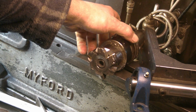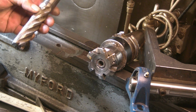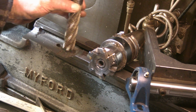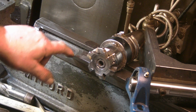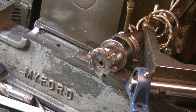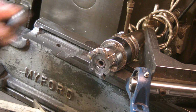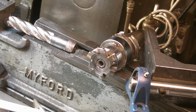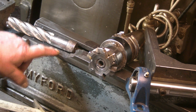So I'm going to experiment with some other cutters I've got. I've got this large roughing end mill, which I don't think I've tried on cast before. So I'm going to give that a try, maybe on this shoulder and possibly on that side of the way. But I have got some other face mills that do allow for a 90-degree shoulder there, so I'm going to try that one as well. Maybe try that one across there to give me that 10 inches from this point. But I'm sure you don't want to be watching 2 hours of machining cast iron, so I'm going to do that off camera and bring you back on the next one when I've got that down and hopefully mount the plate on. Got a little ramp of some plate somewhere.